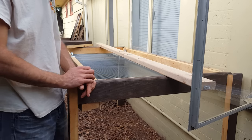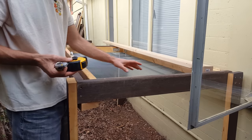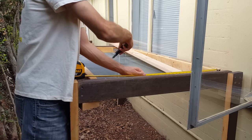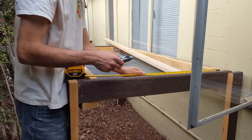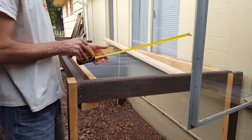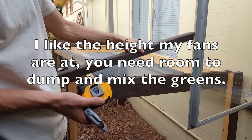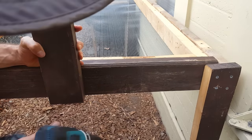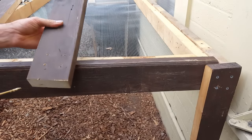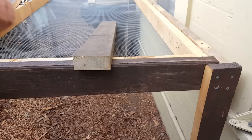I find the center point on each side — that's where I'll put my beams. I want the fans centered over the stainless steel mesh for direct airflow. The table is 32 inches wide so 16 inches is the middle. These side posts are 32 inches long — almost three feet — and were already pre-cut from another project. Drilling pilot holes prevents the wood from splitting and makes driving screws much easier.